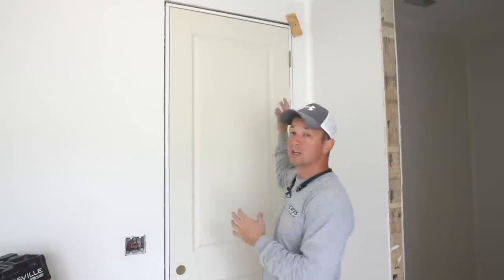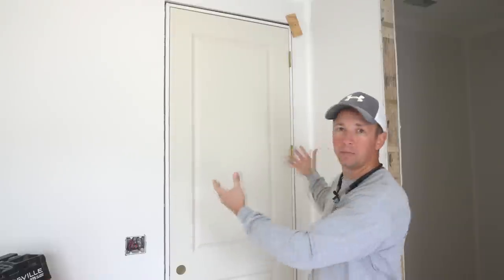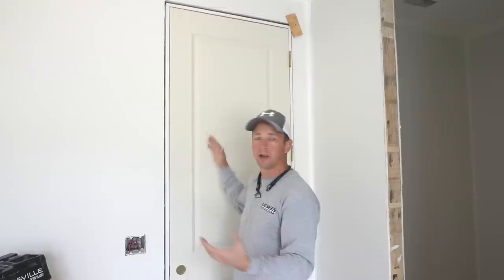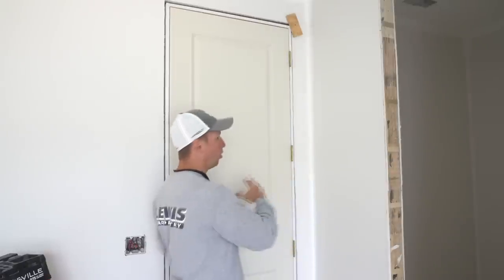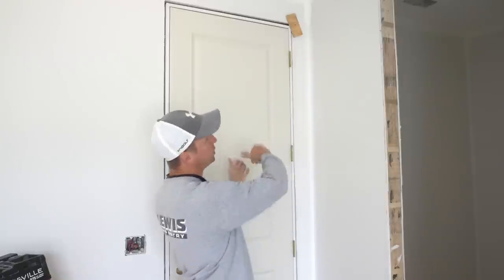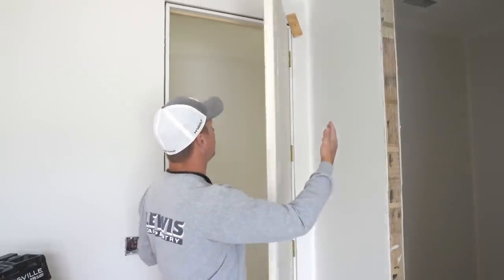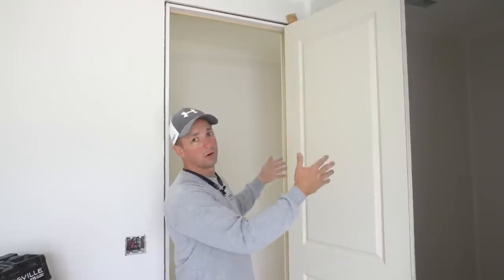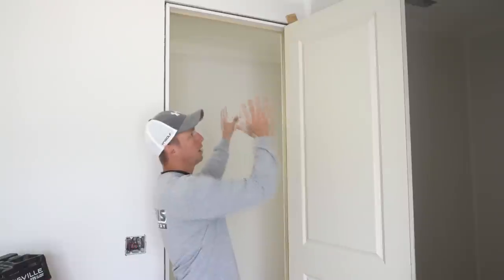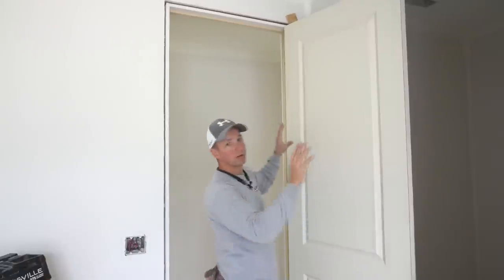What this piece of plywood does: I'm on the hinge side of the door and I need to start tacking it in place, but I can't do that because the door is covering the jam. A lot of guys would open the door, but then the whole weight of the door makes it want to fall forward, the jam pops out of the opening, and you're struggling. So using that block up there, I can just open the door and the jam stays exactly where it's at. This is a two-eight, eight-foot door — inch and three quarters, super heavy. Work smarter, not harder. Use a block up there; it'll hold it in place nice and flush.